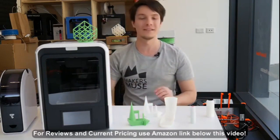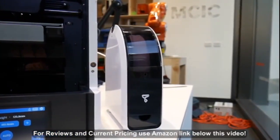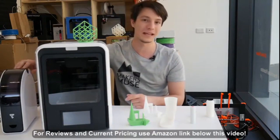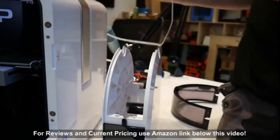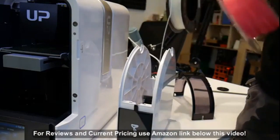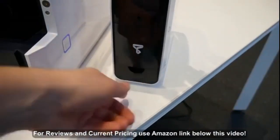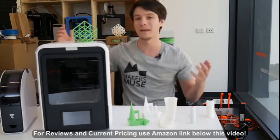Exposure of filament to dust and moisture is a big hot topic in the 3D printing community, and the Up Mini 2 tries to solve this with an external filament caddy that protects the roll from moisture and dust. To be completely honest, this is less useful than it could be. Filament rolls that TierTime provides are 500 grams, they're quite narrow, and they're very unique to their products. That means if you're running 1 kilo rolls or even 750 or 700 gram rolls from other suppliers, they're not going to fit in the caddy — which makes it pretty much completely useless for me. It does have a nice tool holder for your scraper and side cutters, so if you're in a school environment running only Up brand plastics, it might be handy, but for me it's not something I'm going to use.